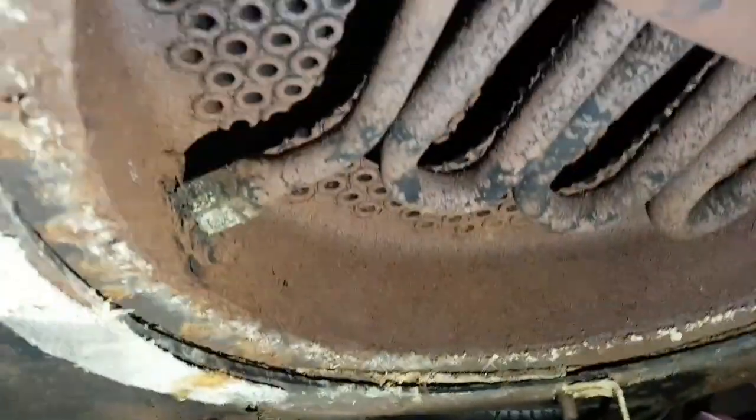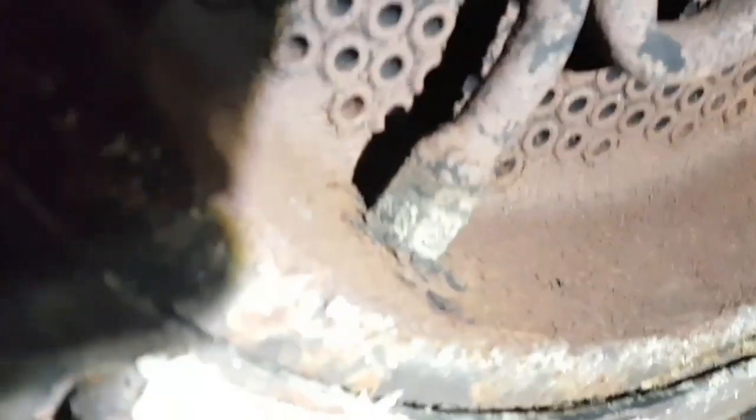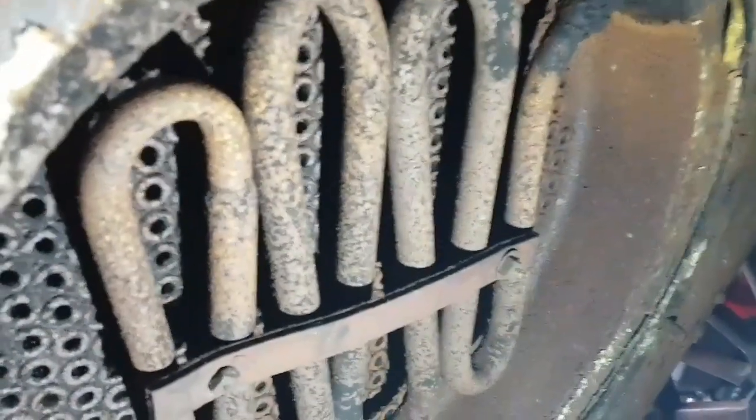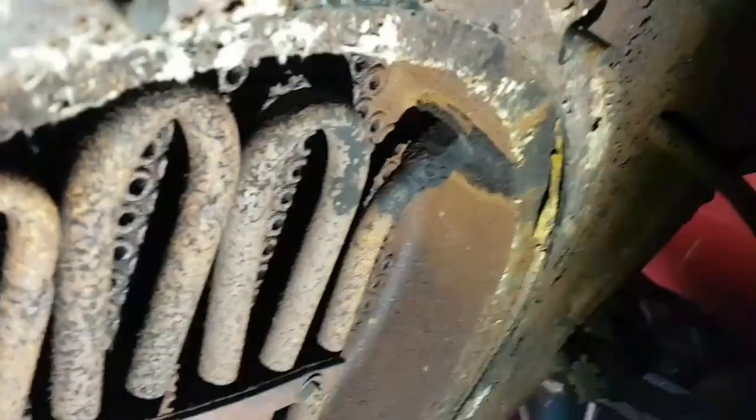The steam comes through the regulator and down underneath the boiler - let's put some light on and have a look. Underneath the boiler there is where the steam comes in from outside into this arrangement, which I think you'd describe as a superheater. It's superheating the steam - drying it out a bit - in preparation for heading up to the back of the car and out through there to the engine.